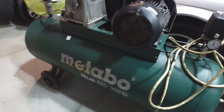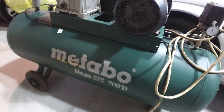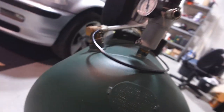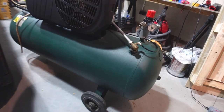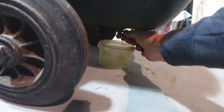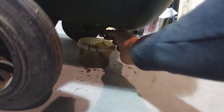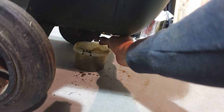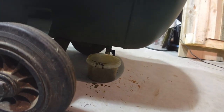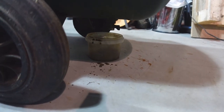Alright, so let's let all the air out. I don't actually have any air tools at all as yet — I don't have a blow-through gun. So I need to use that valve on the bottom to let the air out so we can actually perform our test. Let's check if there's any water in it. I'll put a little container underneath.